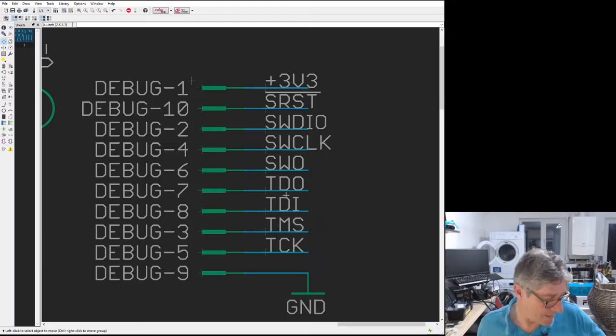which is awkward. But I did mention, probably in my last stream, I'm exploring the possibility of doing my own DAP link supporting debug tool. One of the things that I could do on this, and I'm considering a few other interesting things that most of these debug tools don't do, is I could do the JTAG and the SWD at the same time. And that would be interesting. So if I can get that working, and I will be able to test it if we do a Black Edge board for this connector, that then works. I'm actually thinking of adding that into the amalgam board directly, which is a bigger board or differently arranged board.